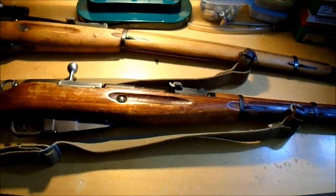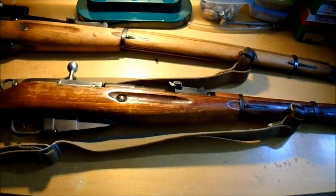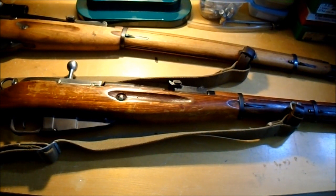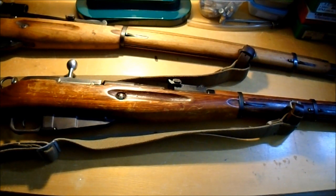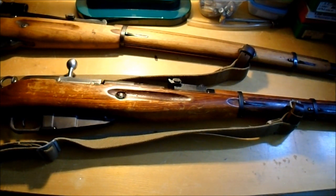Rim lock — yeah, it exists. It's my opinion that it's sort of a case of the refurbishment program as well. You've got poorly made interrupters. The two-piece one was never really the best; the one-piece seems to work better overall. It also has something to do with the ammunition — a lot of surplus ammo seems to have a bigger rim. PPU ammo seems to have a better rim and fewer problems. If you're hunting, you're probably not charger-loading anyway, so you can stack the rims to avoid this issue. The Finns saw it as enough of a problem that they modified their magazines to combat it further.